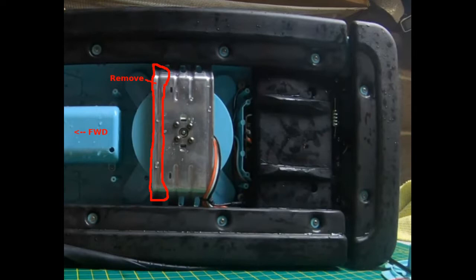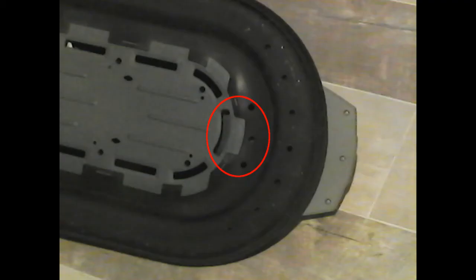Underneath the model, there is a large metal bracket that holds the lift fan brushless motor. This bracket blocks some of the air exiting the slots. By removing the area shown, we remove weight forward of the center of gravity while increasing airflow. I also opened up the forward-most exit holes to again remove a little bit of weight while increasing airflow, especially in the front of the vehicle.